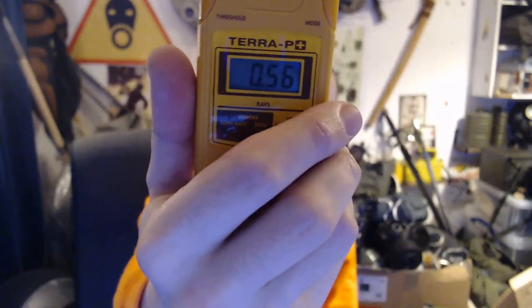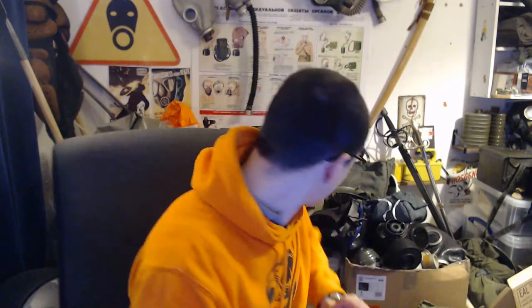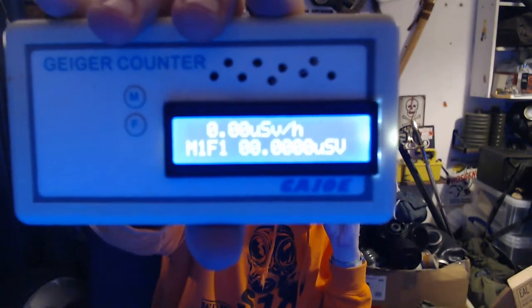The safest way of avoiding gamma rays is just to get away from it as fast as possible. Unfortunately my Theremino has gone back to about 0.5 microsieverts — I guess some radionuclide got into the case near the GM tube, giving a high reading. The wall-mounted Geiger counter — if I turn this one on — when this gives a reading it should go to about 0.25. Oh, it's dropping down already. I think it might be picking up the radium off that item. There's something under my fingernail or something — a bit worrying.